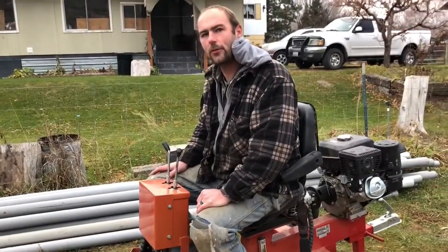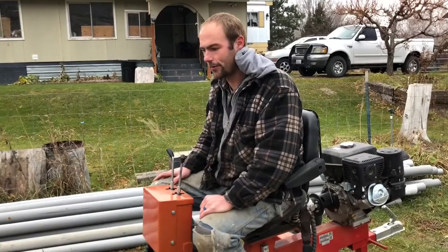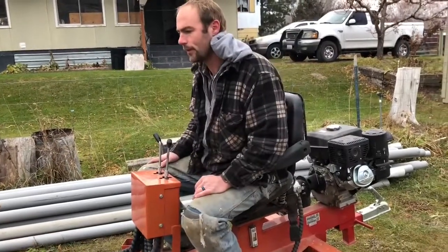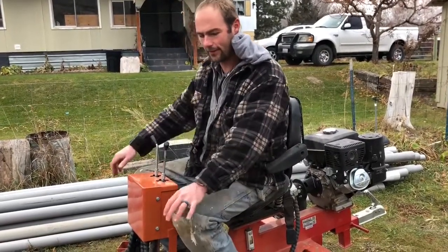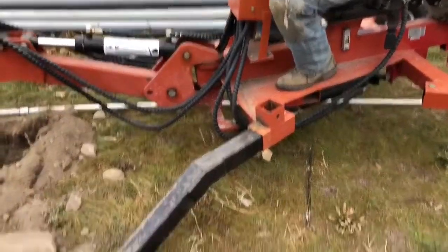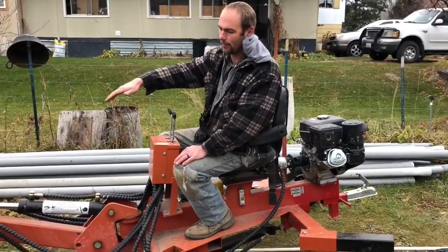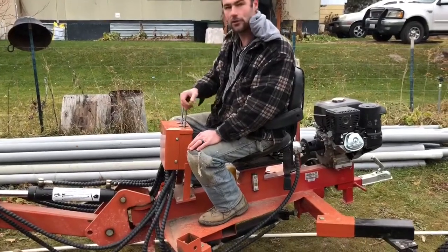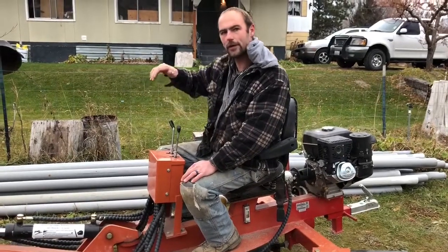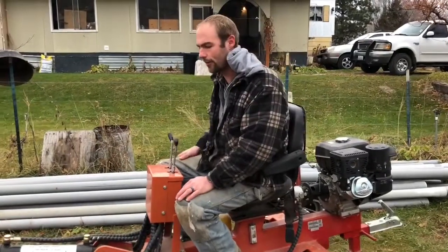I could compare it to an excavator, because I've had quite a few hours on an excavator. The big difference is there's no weight to this thing. So the only power it has is against the feet there. And there's not a lot of weight. So when you're pushing down, I think you'll see that when I show you a little bit. But you have to continually raise the bucket up when you're pulling, when you're dragging the teeth, especially if it's hard, because there's no weight